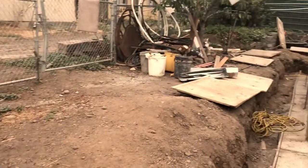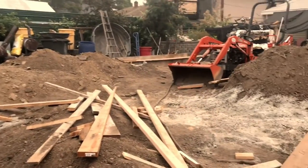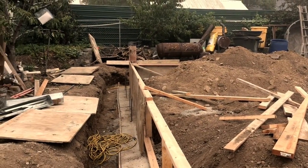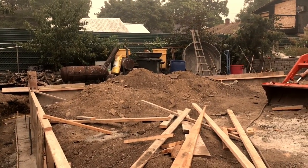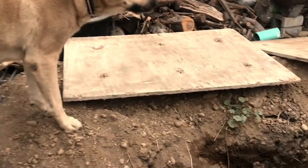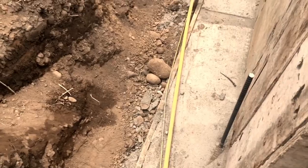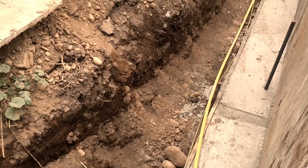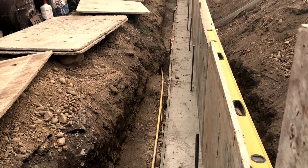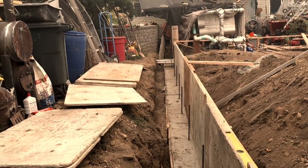Going to have a 12-foot door back here coming in off the alley. It's kind of a mess where it's at — work in progress. When you've got as much stuff as I do you've got to just shift it to get something built to put it in. There's my gas line going down to the house. It's actually just plastic, and it should bend over enough to miss my wall once you push it over. That gas line right there has 35 pounds of pressure in it and you can't run it in your slab. I think we're going to get away with just pushing it over. There's my other plumbing down there which goes up to my waterfall.